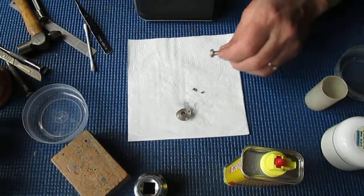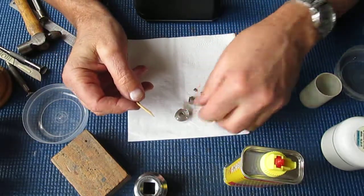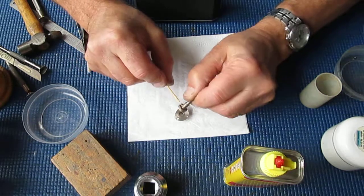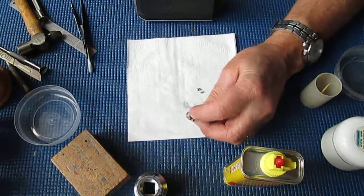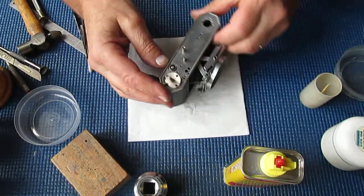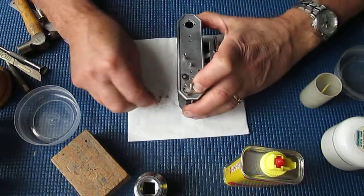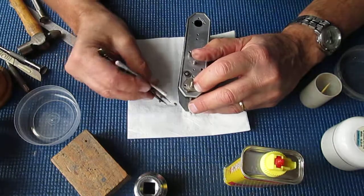Okay, so a bit of lubricant there, which I'll apply to the shaft at this point and on this face where it runs against the collar. That can go on there. This only goes in one way and you've got to rotate it to get this coupled up with the top of this take-up spool. That's good. 3 screws.